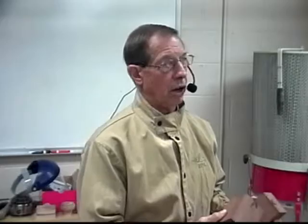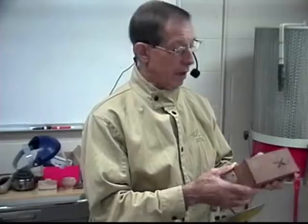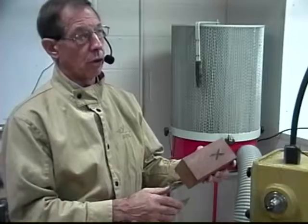But to start out with, it's a 2-inch block and a 4-inch block. So you just take your table saw, make sure the blade is 90 degrees, either use a framing square or your digital gauge, so you're nice and square, and cut off a 2- and a 4-inch block, and then mark the grain pattern. So when you go to drill your holes in here, you don't wind up this way or down on the other end or something.